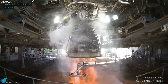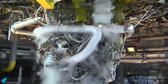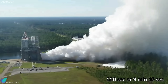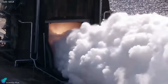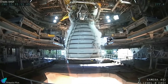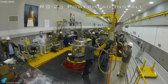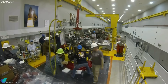The most recent test at NASA's Stennis Space Center in Mississippi took place on October 17th and involved a single RS-25 engine. During the test, engineers closely monitored the engine profile, nozzle, hydraulic actuators, turbo pumps, valves, and other systems to ensure everything was functioning properly. The engine was operated up to the 111% power level needed during an SLS launch. The hot fire test, which lasted for 550 seconds, marked the first in a series of 12 tests scheduled to stretch into 2024. These certification tests will provide NASA with crucial data required to produce an upgraded set of engines for future Artemis missions, with changes including new manufacturing processes and lighter components that will result in lower production costs and shorter production times.